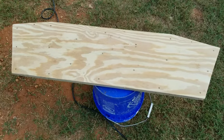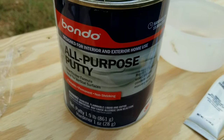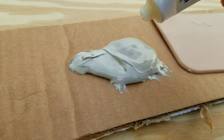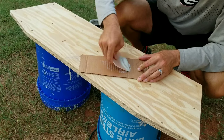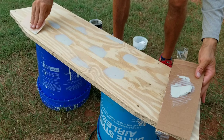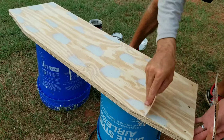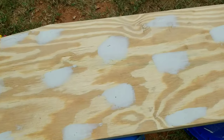I'm going to bust out the Bondo and mix it up and fill in these holes. I'll leave a link to it on Amazon in the description — it's Bondo all-purpose putty, interior/exterior use. It's a two-part deal: you mix some cream hardener in. The more hardener you use, the faster it hardens. Bondo is all cured now and I'm going to get to sanding.